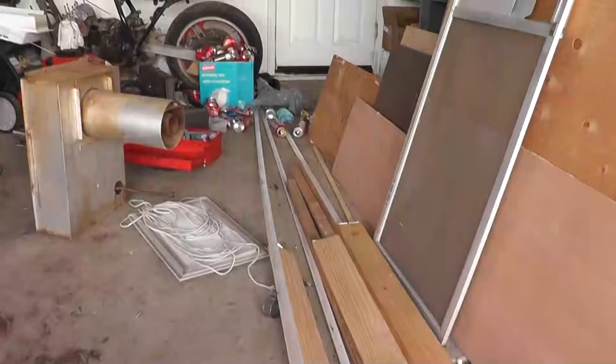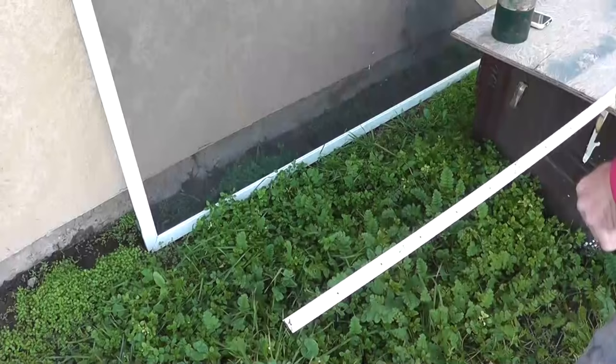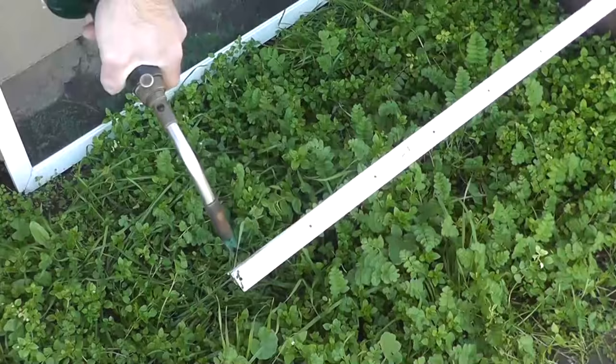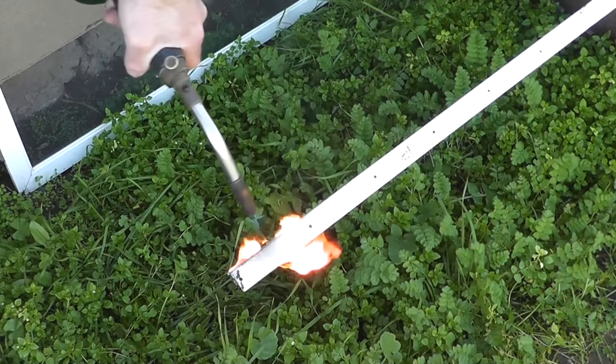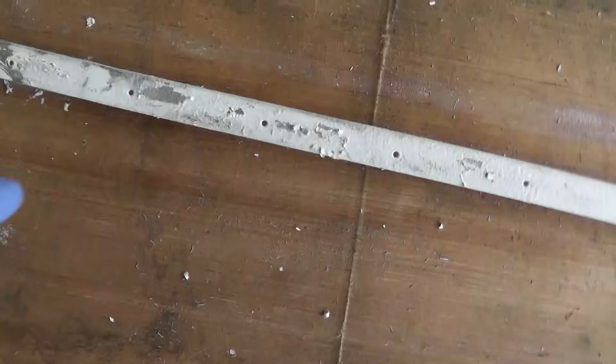What I want to do now is figure out how to get the paint off of these pieces. I really like the look of bare metal, and with all the bending these things are going to be put through, there's no way a painted finish would survive. My first attempt was to use my propane torch and just burn the paint off, but that didn't work as well as I had hoped and it created a lot of toxic fumes. My second idea was to use my orbital sander, but that method was really slow and went through about a sheet of sandpaper for every foot of trim.